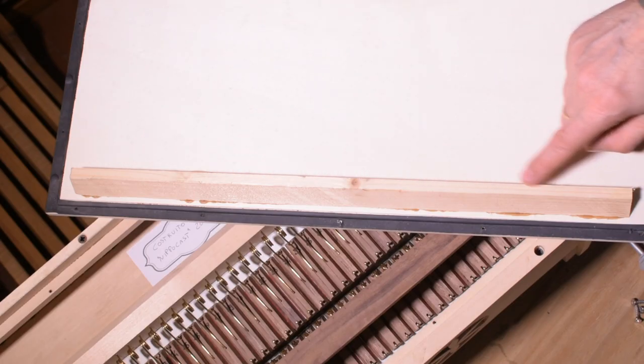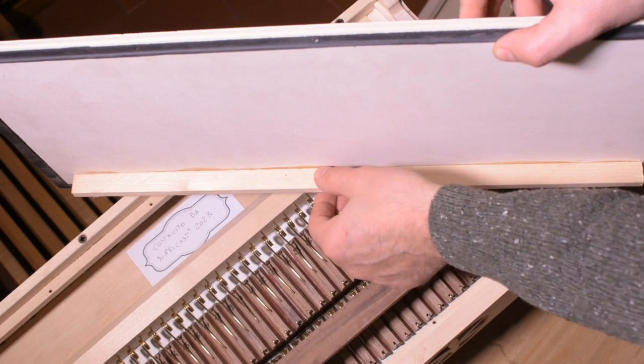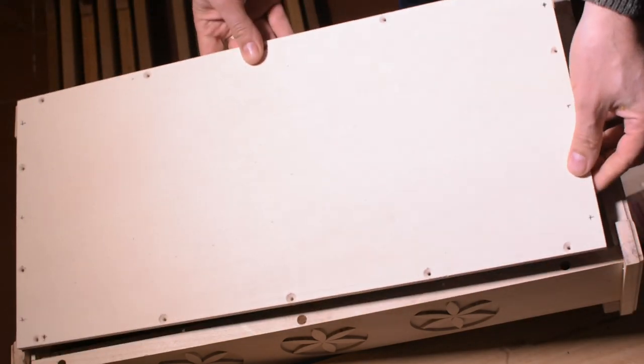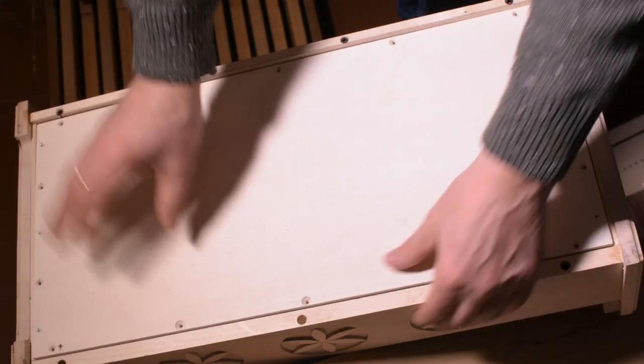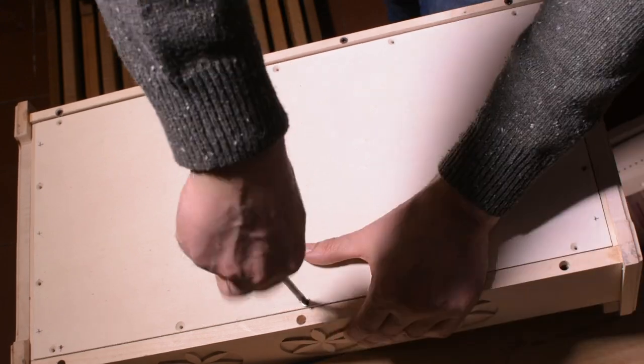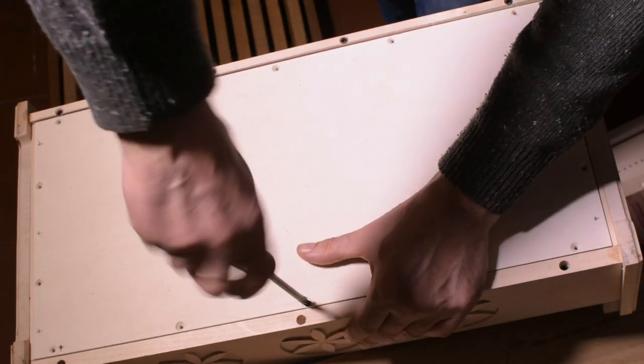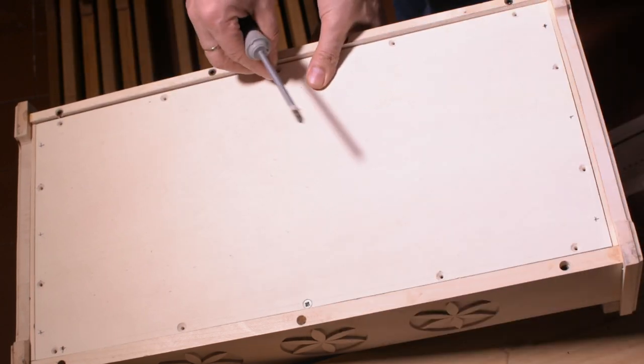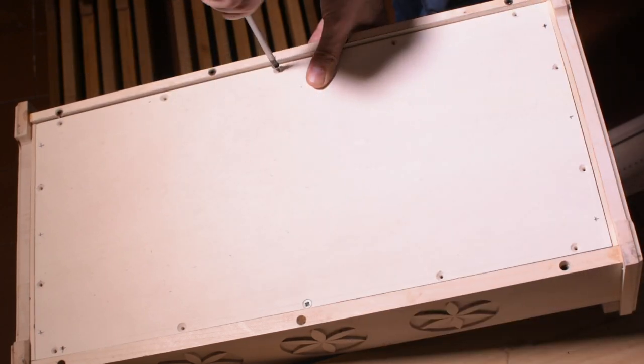The cover is made in such a way as to compress the spring holder in order to keep it straight and not subject it to mechanical stress. For maintenance, once the cover is opened, just loosen the spring holder to loosen the pressure of the springs and then retension them before closing it again.